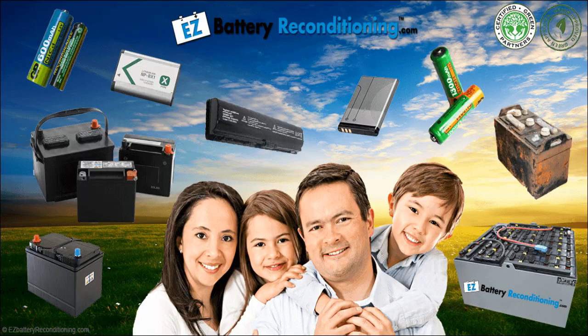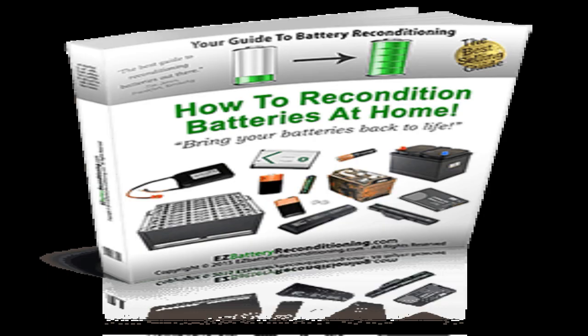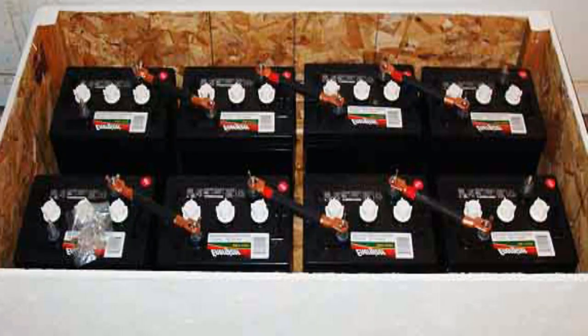The three best batteries. Now that we know we want a flooded lead acid (FLA) battery with deep cycle properties, here are our three favorites. Number 1: Golf cart batteries. Golf cart batteries are the most widely manufactured batteries on this list and work great in an alternative energy system application, making them one of the most commonly used batteries in battery banks for renewable energy systems. Even though the five to six year lifespan may seem relatively short, golf cart batteries more than make up for it by being extremely durable and cheap. They can also be found almost anywhere, making them a great choice for battery banks.